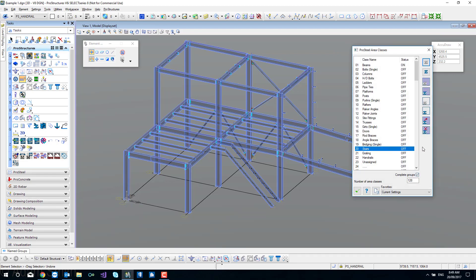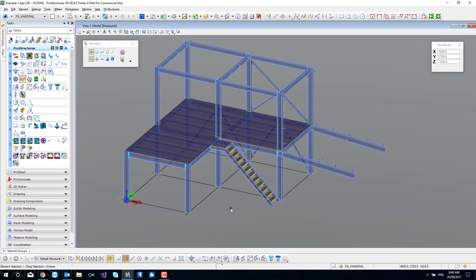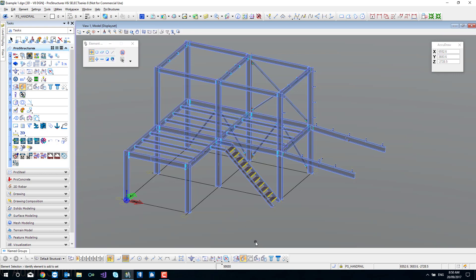I want to see the step treads for the stairs. I could come in here and turn stairs on if the stairs were grouped, or alternatively it looks like I've put them on grading, so I'll turn the grading on. I'll probably turn the rest of the grading off so that everything's top of steel rather than top of grading. But in my marking plan I do want to see the step treads. Using hide, I'm just going to turn this other stuff off. It's up to you what you want to portray in your marking plan - in this case it's just the steelwork and the step treads.